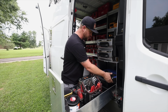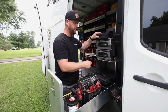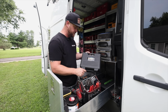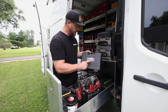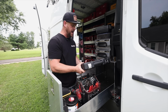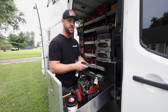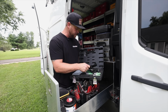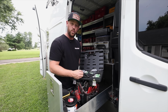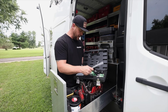And then back here, I've got my scales by Fieldpiece, so refrigerant scales. I've got my infrared refrigerant leak detector. This is the DR82. This is a really good leak detector. And then I also have a Hilmor pipe cleaning kit. So this is for when we're doing change outs and we need to clean the inner diameter of the suction line, right? If we're reusing the pipe, we want to remove any residual oil from an older system to the newer system. And that's what this kit does.